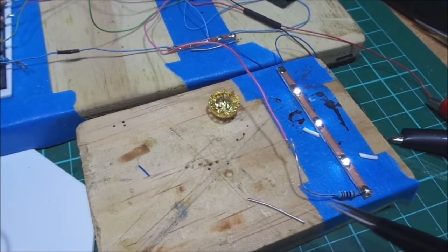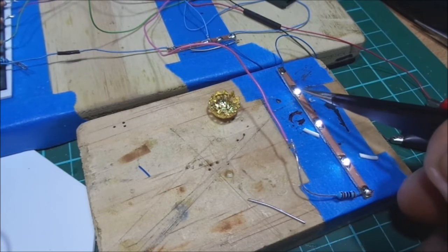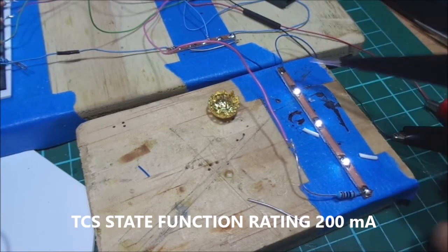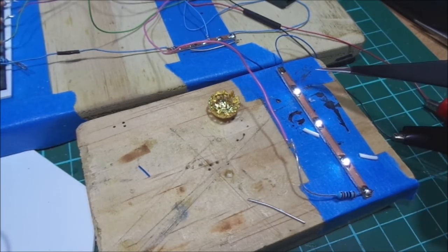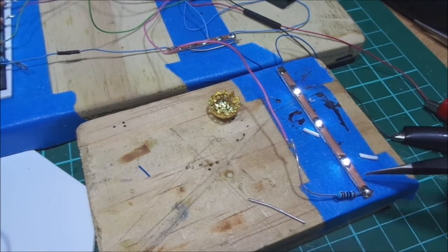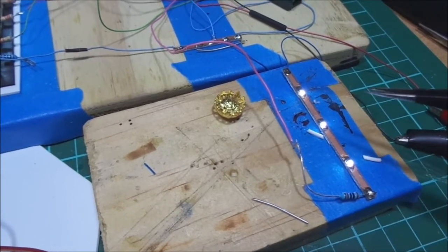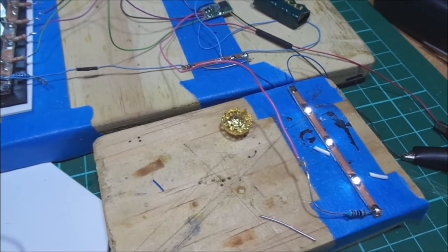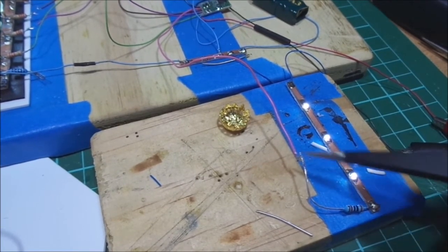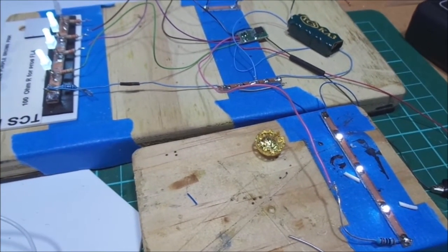There's my light board. I've just got a 1K resistor on it, so all three LEDs are in series and each of those LEDs is pulling about 20 milliamps — so 20, 40, 60 milliamps. The circuit of each one of these is going to take a hundred milliamps easily. Different LEDs have got different voltages that they pull, so I allow about 3.3 volts on those white ones — so 3, 6, 9.9 volts. If I put another one in there, that's going to be over 12 volts, and when you're over 12 volts which is the output from the decoder function, you're not going to run four LEDs successfully unless you drop the resistor value down. Three is enough, and you could run three and then another three on the same function — the pink goes to this resistor and the pink goes to another resistor with another three on it — but be careful with overloading.